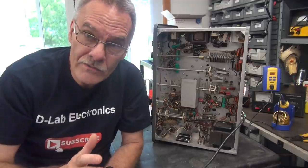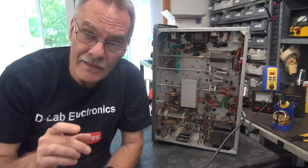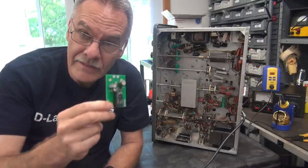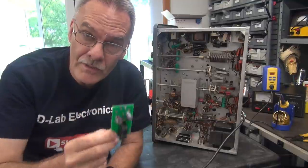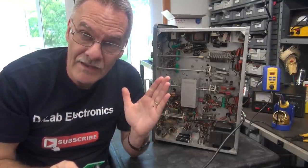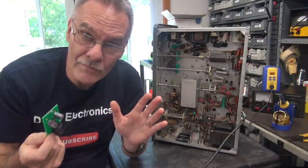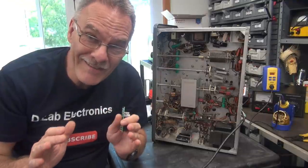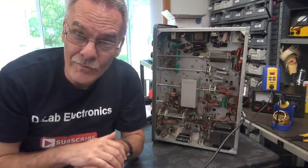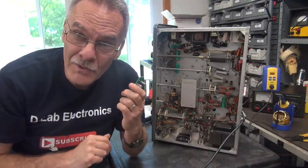This is not a total loss. I still want to go ahead and install a push-to-talk module and get that 200 volts off of the mic line. So I have a D-Lab K1 module. We're going to replace that relay and lift the high voltage supply - this one will run at about 14 volts on your microphone. Then once I get all that resolved, I need to go dig out another T2 transformer and get this thing back to stock.